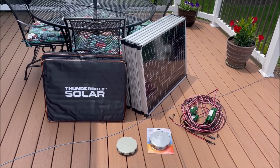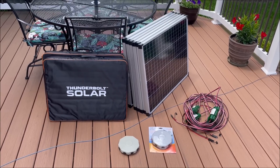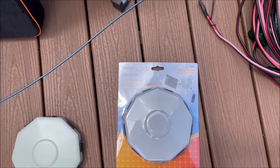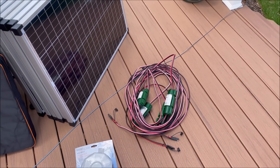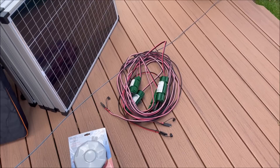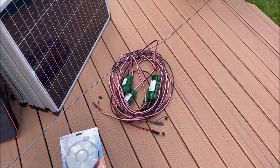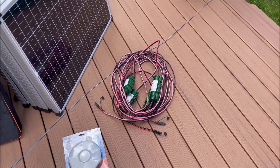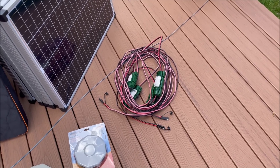I'm using six of the fixed 100-watt panels, two of the folding briefcase panels, and two of these 400-watt universal solar connectors and my house cable. It's about 60 feet of number 10 cable with SAE connectors. Eventually I'm going to convert it all to MC4 and instead of having three 20-foot pieces, probably just go with one 60-foot piece of number 10 PV cable with MC4 connectors, but that's to come in the future.